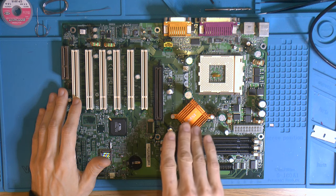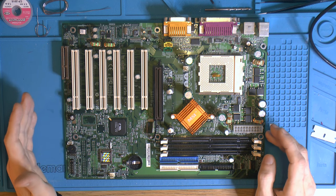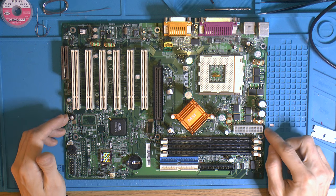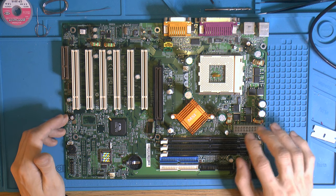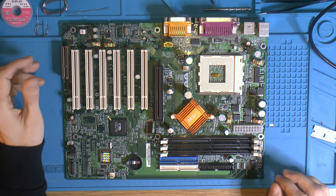They're all VIA-based KT133, some are 12V depending on the version, some are 5V. So if you have a 12V board, you will have a 4-pin connector next to the ATX here, which is obviously more desirable. The one with the ISA slot is not installed, the Turbo 2.